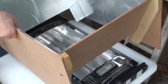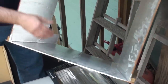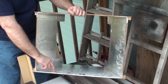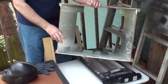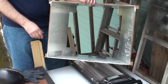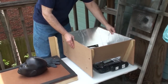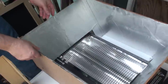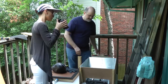Here's the heating box. It's very simply made, just out of particle wood, and inside it's just aluminum foil that I spray-mounted to the walls with Super 77. It is amazing how the foil reflects the heat off the wood — when this heats up really hot it'll get over 350 degrees, but the wood on the outside stays very cool. Just the heating part of the heater is exposed; the rest of it is on the outside of the box.